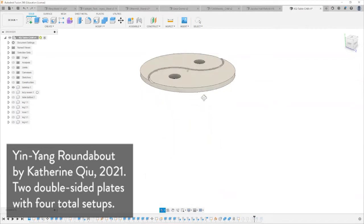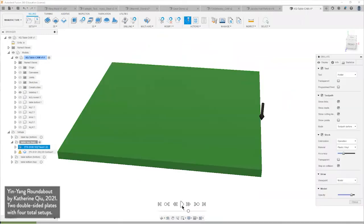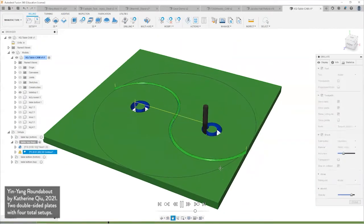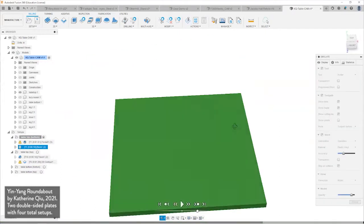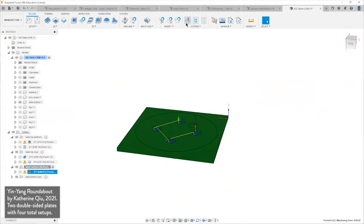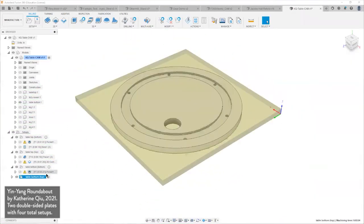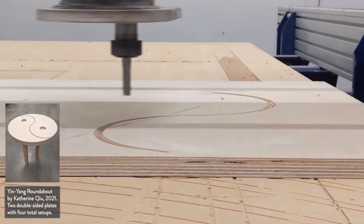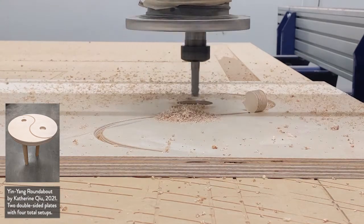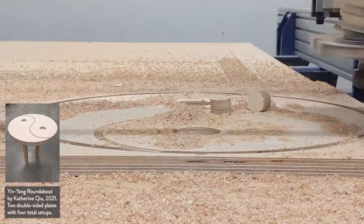We won't talk much about CAD in this video, but if you want to use our JPS service, make sure your part is machinable and as organized as possible before sharing with our design specialist staff. Before exporting, try to hide irrelevant components and only feature the part you wish to machine in the orientation you wish to machine it. Before exporting your file as an F3D or F3Z, please set up your CAM to the best of your ability. We prefer to discuss CAM generation during a scheduled meeting rather than make assumptions about the resolution and tools you'd like to use.